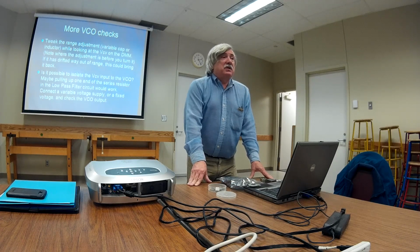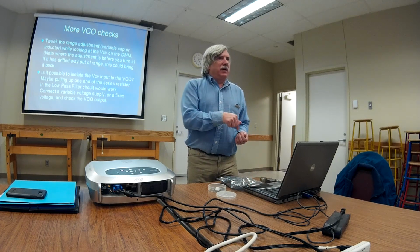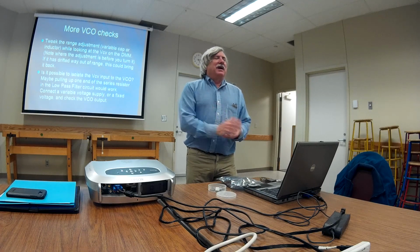Wow. Yeah, I can believe that. Yeah, especially for UHF and higher. Yeah, laser trimmed strip line is not uncommon because coil and core type inductors get really tiny. So I don't have any experience with that, but I wish I did.